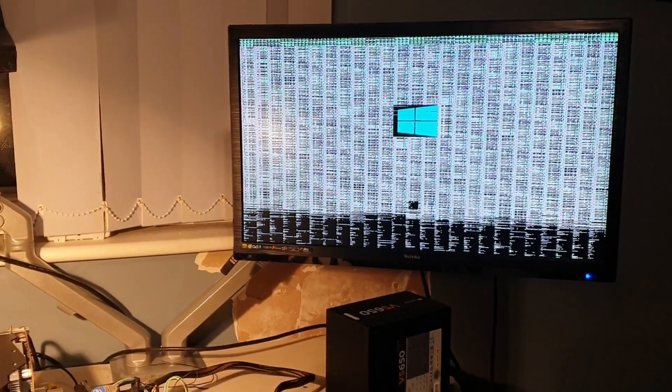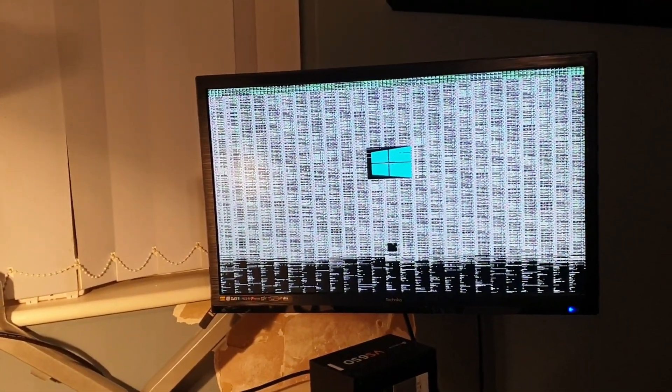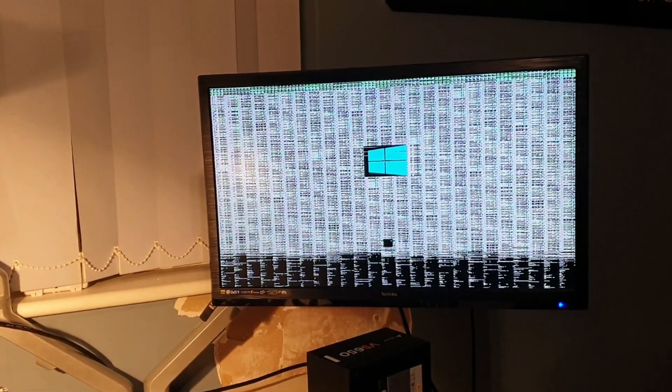That BIOS is displaying but as you can see it is totally corrupt. I'll put the driver in and just see if anything does make any difference. So I tried 10 different BIOSes, none worked. The original GT640 that the GPU is didn't work - it had DDR3 RAM which I think is conflicting with the GDDR5 that is on the card. I will post in forums to see if anyone has got a BIOS that works, as there are no posts about others who have tried to flash the GT640 back. If I find a working BIOS I will update this video. Here is a list of games tried that didn't work or got past the initial loading screens then crashed when the game started - this is because of the wrong memory allocation.